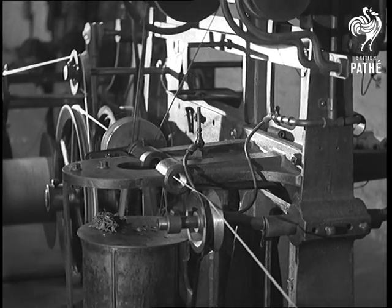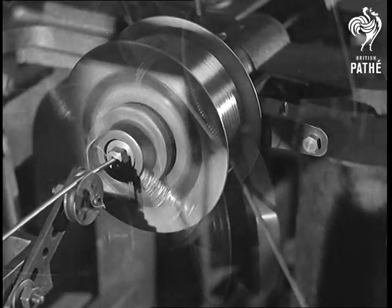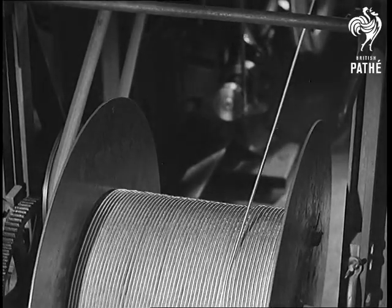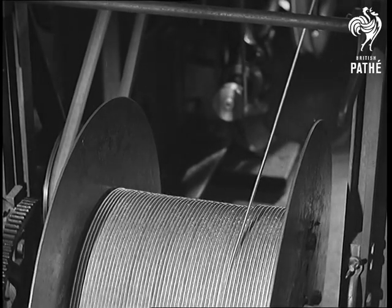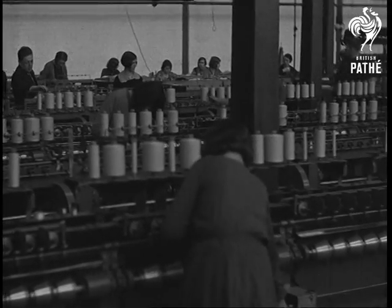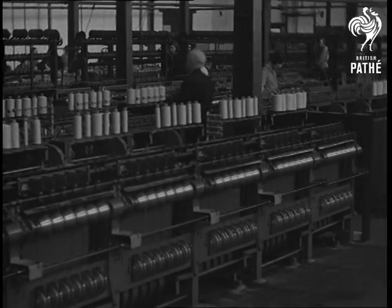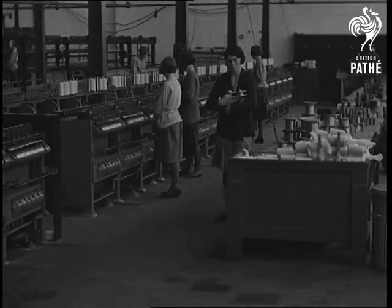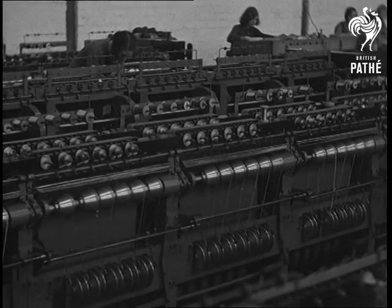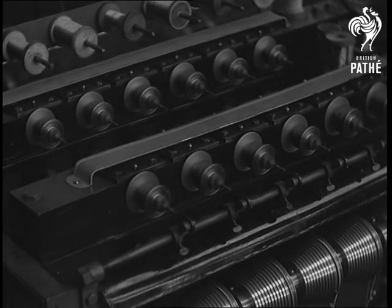Motor car cables are provided with several different finishes, and one of the most common is an armoring of a spiral of bright aluminum wire. Most of the conductors you have seen are made of copper. In order to provide the exceptional flexibility required by telephone instrument cords, the conductors here are made of tinsel. Other machines are covering very fine wires with a layer of the purest quality silk. In some cases, wires as small as one thousandth of an inch in diameter are covered.